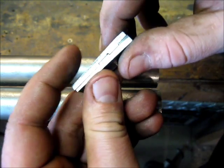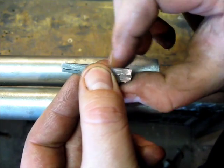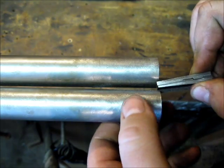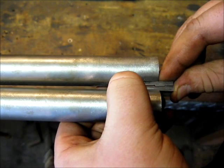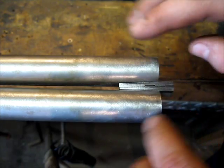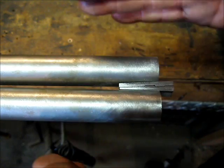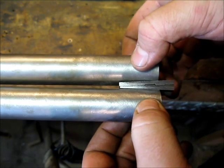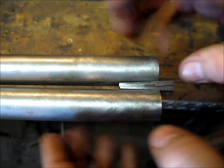They key together so that they slide up and down, and they're also wedge-shaped — a little wider at one end than the other. The way this works is I'll solder these two parts together and then solder both of them in between the barrels. With the wedge being keyed like this in two parts, it allows me to regulate the barrels both for the horizon and for the spread. As these go up and down I can change the barrel on the horizon, and as I push it in or out it will spread or let the barrels come together.